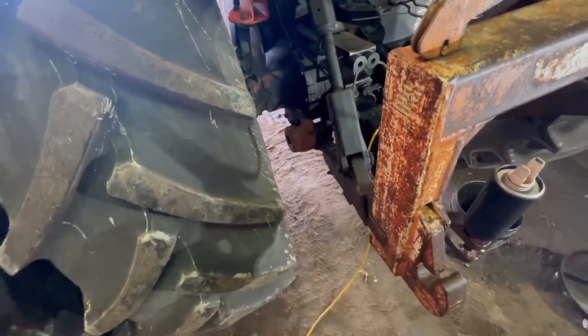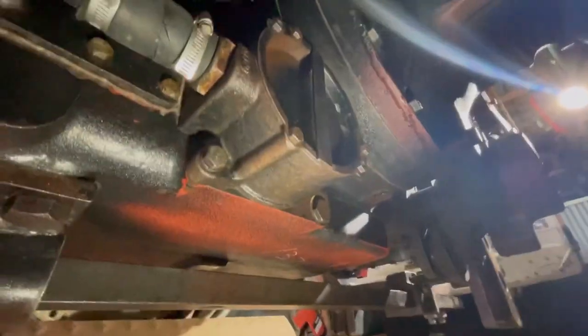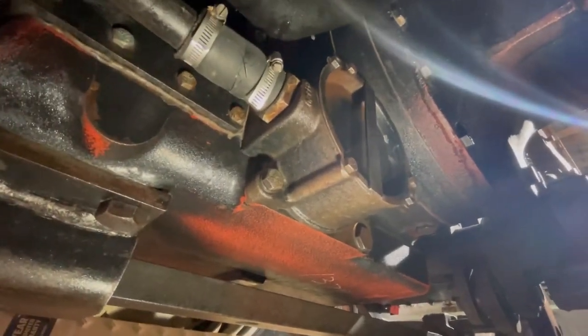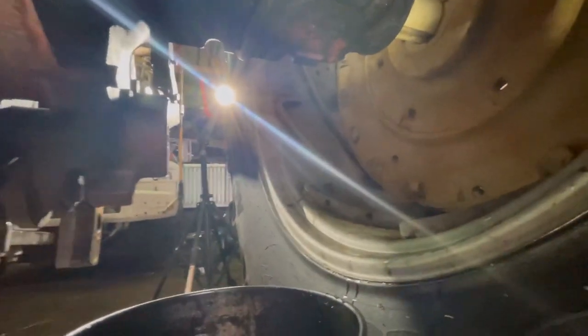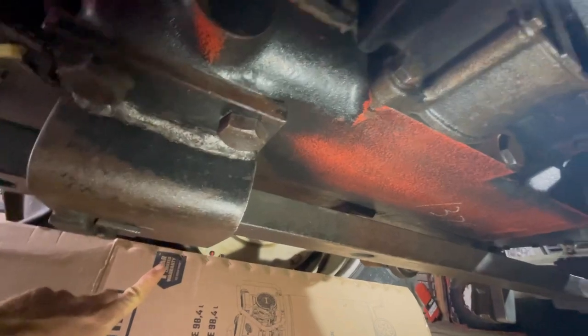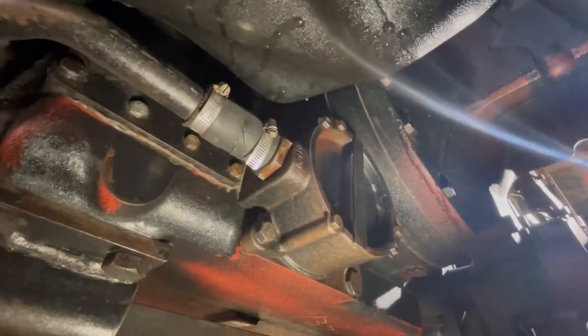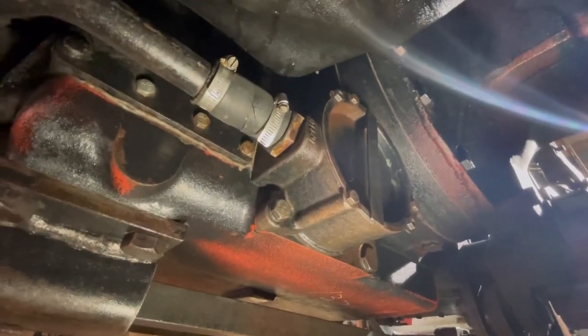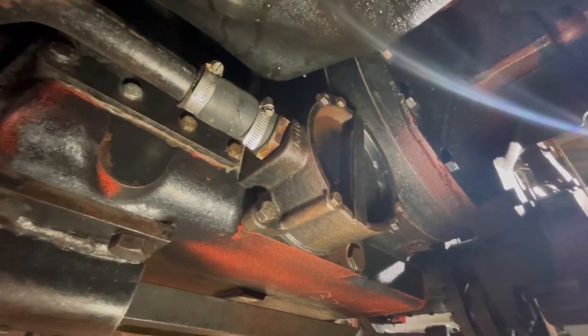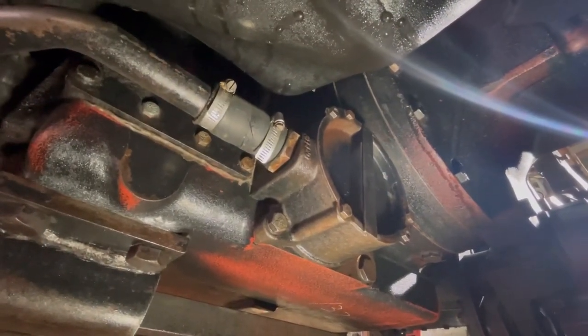Let's see here — I'll try to bring in one of the hydraulic filters. That creep underneath though — I've got to get my creeper and roll up underneath there and get them popped out. Alright guys, I'm up here underneath the tractor on the left-hand side. Right there is the tire, and right here I've got to take that cap off — there's a filter that goes inside that. It's the same thing over here on the right-hand side. There are two filters and those are the hydraulic filters. Being up underneath here is why I can't film while I'm doing it. I'm not even going to bother trying to film the right-hand side because both sides are identical — same thing.